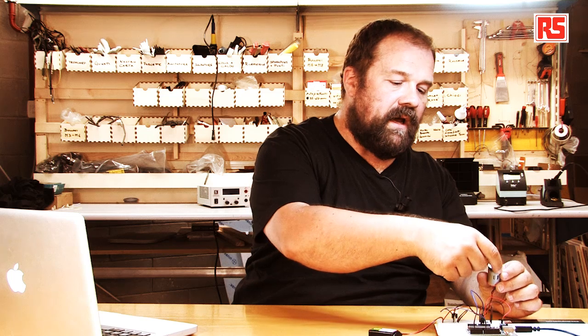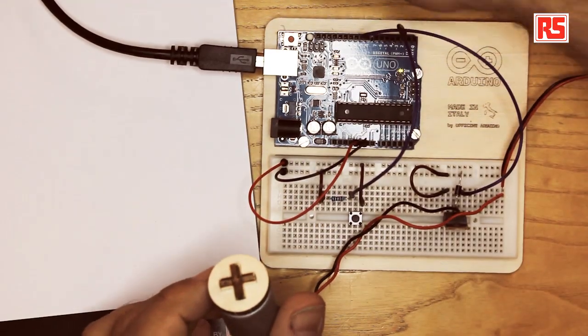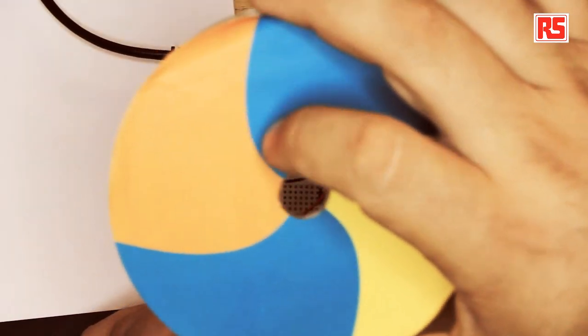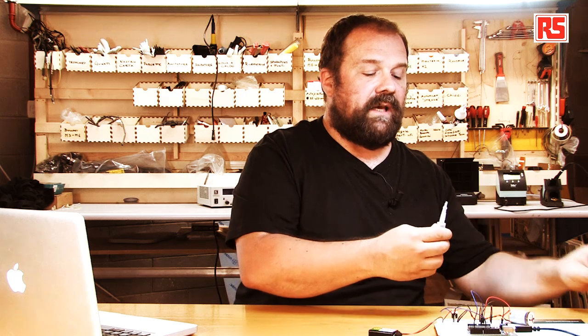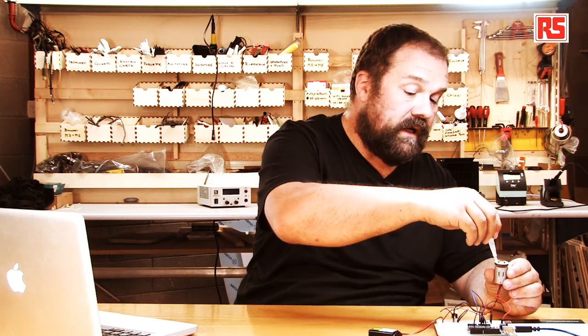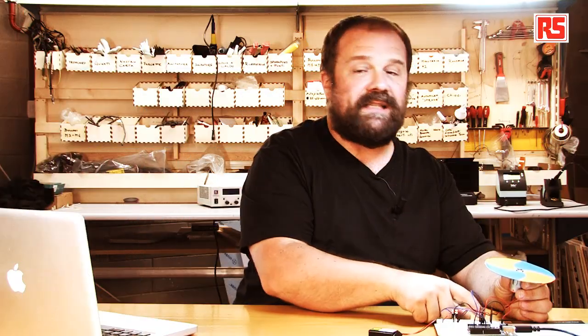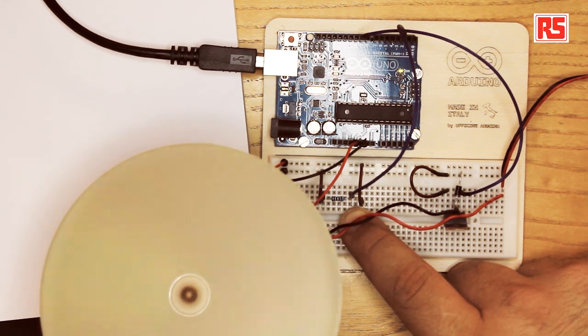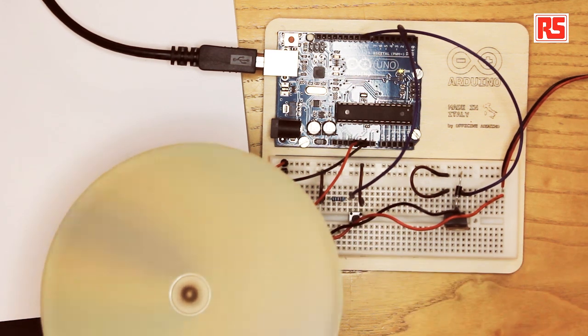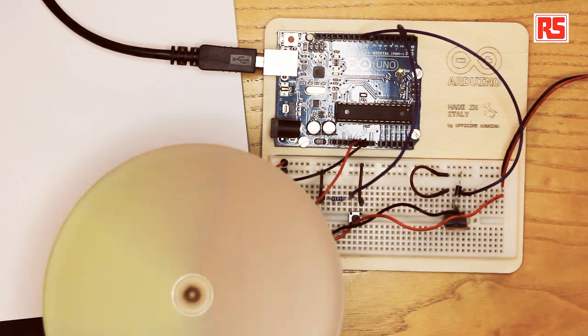Every time I press the button, the Arduino detects that condition and turns on the MOSFET. Here we have the motor with a small adapter connecting the motor shaft to the pinwheel made from an old CD and a piece of paper from the kit. I'm going to put a little glue on the adapter so the CD doesn't fly away when the motor turns on. You can see it picking up speed and turning a nice color — and if I release the button the motor starts to slow down.